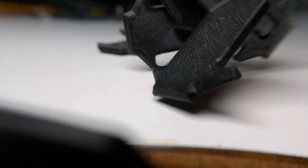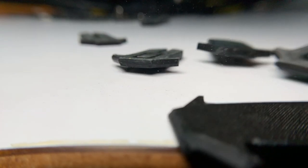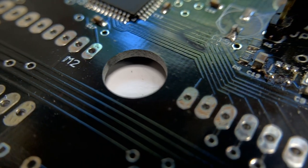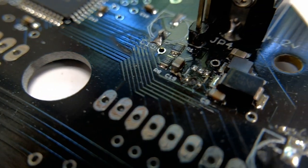My streak of good luck seemed to have run out. The hooks were rubbing together and I had to reprint 120 of them. I had a lot of board failures trying to run it using just a single power supply. And worst of all, at 60 threads, the loom was jamming. It was time for some redesign.